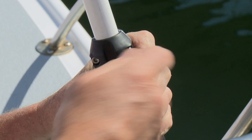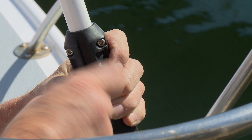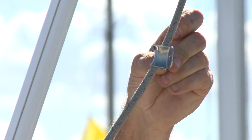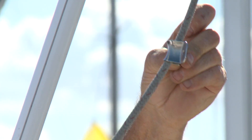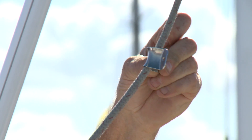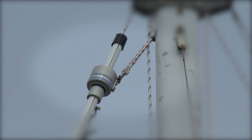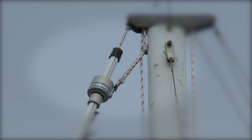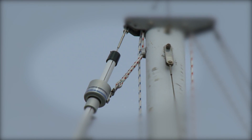This clamping is holding the extrusions together, preventing them from driving down on top of the swage stud, and it provides a nice entry for the sail luff tape. One small but very important detail is the addition of a little clip called a pullback device, which comes standard in the kit. It's a small stamped metal flared fitting that goes against the mast up at the top and creates an angle away from the headstay angle. That gives the swivel the mechanical advantage it needs to stay put as the furler is being rolled.